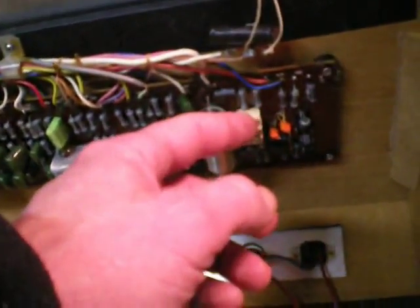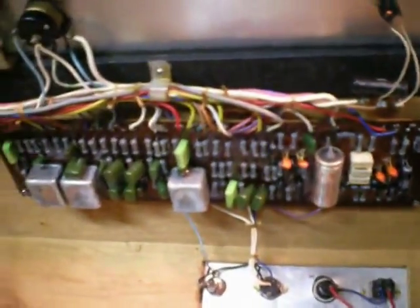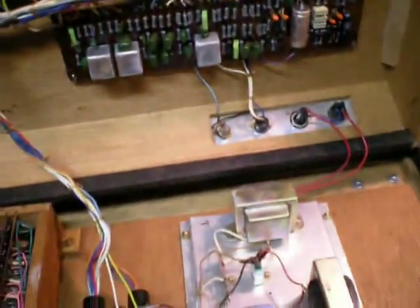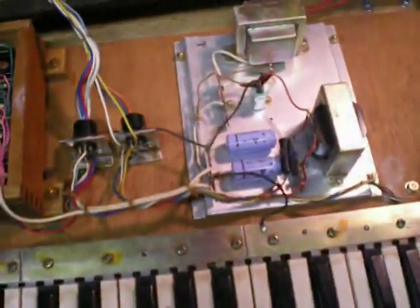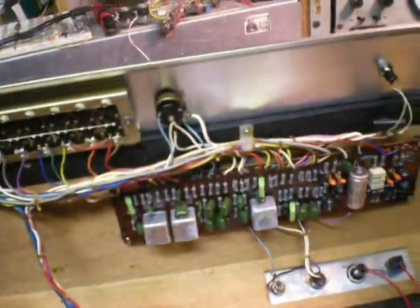All the capacitors failed. I put 0.27s and hung a 0.1 under to make a 0.4 — 0.37, close enough. Gives you a nice vibrato. The vibrato didn't work, and a lot of dirty switches. The caps are all holding their ESR value well enough. I didn't see a single bad electrolytic in this, did I? Just those three there.